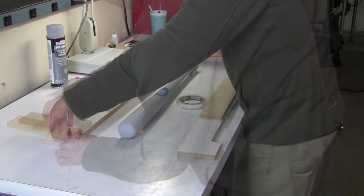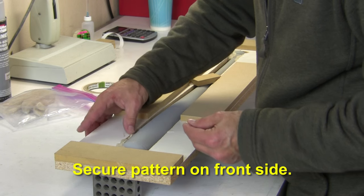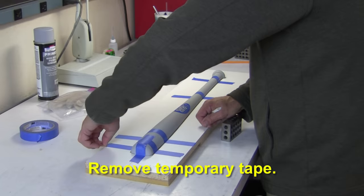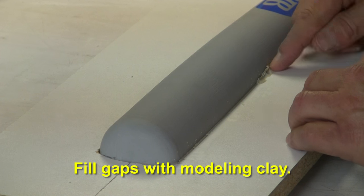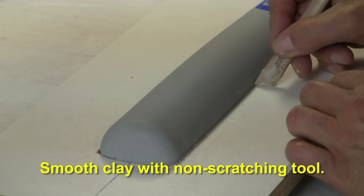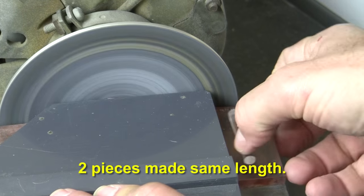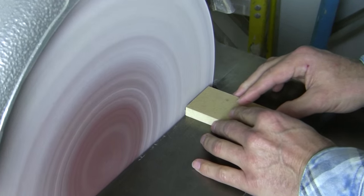Using more double-sided tape and MDF board, we join the two splitter board halves together. The pattern is secured on the front side with masking tape, and the assembly is flipped over. The pattern can be secured with a combination of clay and hot glue to assure things don't move around. When satisfied, flip it back over and remove the temporary tape holding the pattern. We'll now fill gaps between pattern and splitter board with clay — pack it in and scrape it smooth using a non-scratching utensil made from plastic or wood. We begin to make our air vent using an acrylic rod; two pieces are made to the same length. One piece is hot-glued to a piece of wood and sanded to half its diameter so it will sit flat on our splitter board.